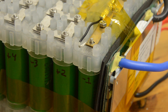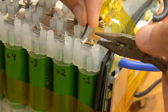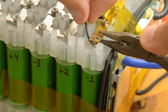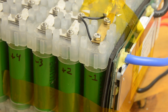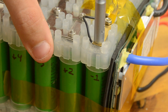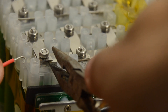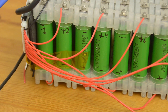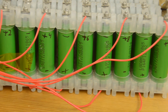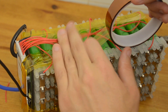Now I'll add my balance wires. I'll start with my minus one wire, which is the black wire. I like to wrap these around the threaded post, but I go under the bus bar, so it doesn't get in the way of the flow of electricity and the series connection between cells. I'll tighten down the nut after I've wrapped the wire around the post for my first balance wire connection. The next wire — actually the second wire — is the plus one balance wire, so it'll go on the positive side of the first cell group. Then I'll do the same thing with each successive wire until I reach the 11th balance wire, which connects to the positive end of the 10th cell group. I like to hold these wires down with Kapton tape, but you can use hot glue to hold them in place as well.